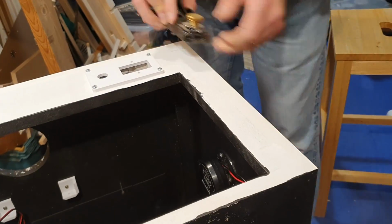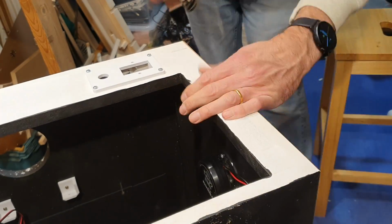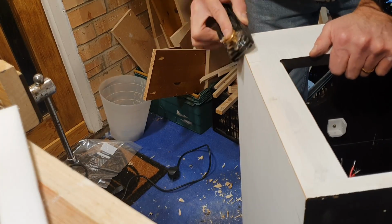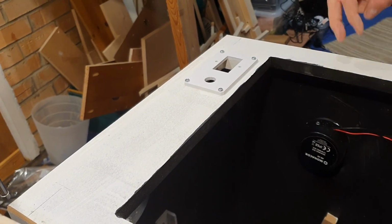The inside of the legs is not a perfect right angle. There's a small radius, so I need to remove the corner of the cabinet where it will be against the leg. A small block plane is the best tool for this, even my extra cheap and nasty one. I knocked off the corner all the way up the edge and took some extra where the leg would mount.